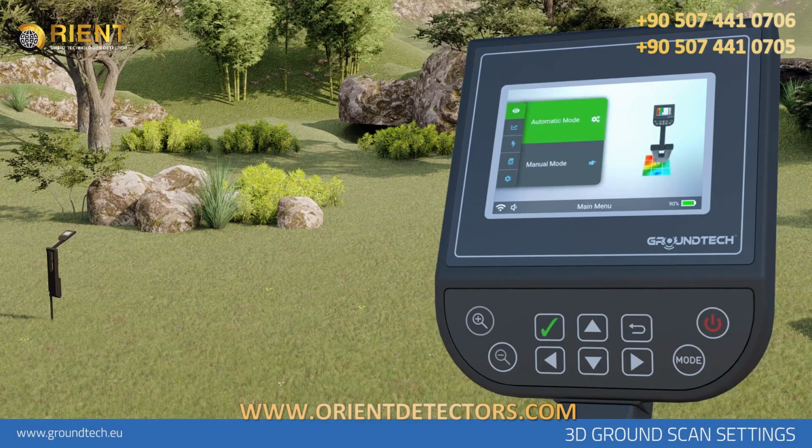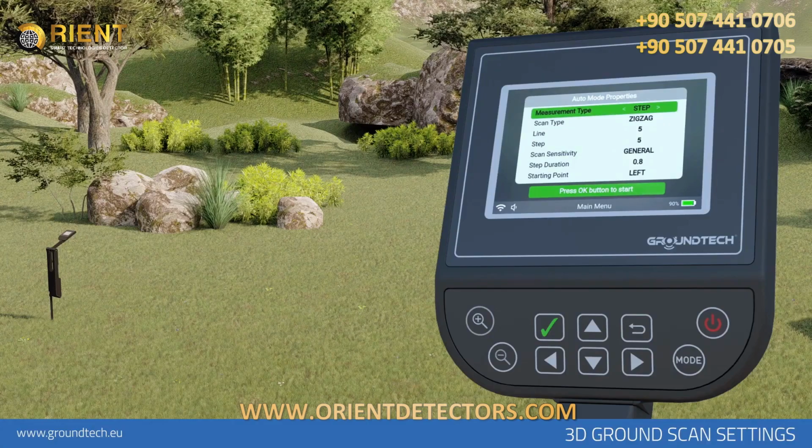When you select automatic ground scan, you will be directed to the settings you need to make before the search, respectively. Measurement type. You must choose the number of steps or meters. In the step option, you have to enter step numbers in step and line options. For example, 5 steps, 5 rows. In the meter option, you must enter in meters in step and line options. For example, 5 meters line, 5 meters row.